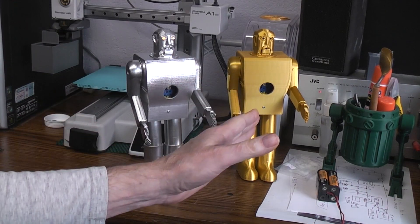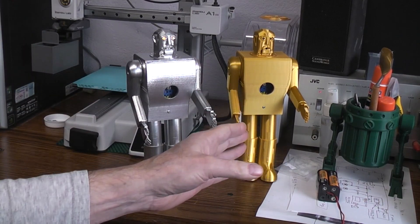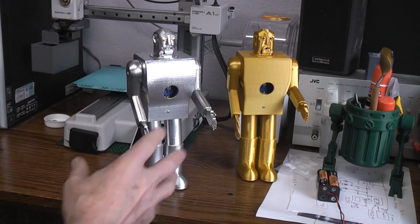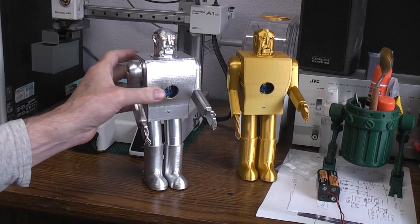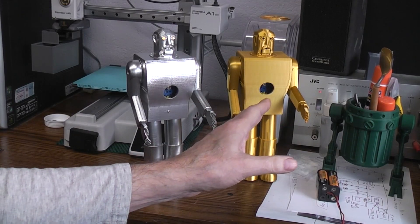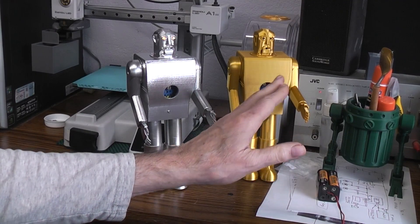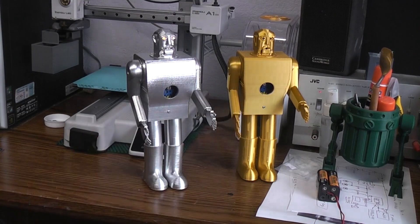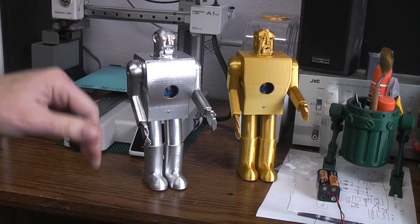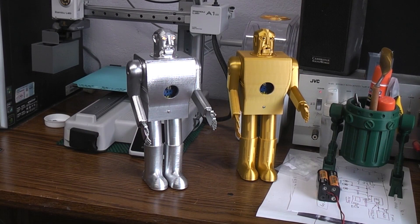I do like the idea of three batteries instead of two because it simplifies the circuit by eliminating the boost circuit, extends battery life, and gives the TT motor four and a half volts instead of just three — all things that favor going that direction. As soon as I have enough time I'll upload a new file to Thingiverse with the changes I made for separating the legs, the three-AA battery configuration, and a link to this video for people who want to do the speech recognition. In the description of this video there'll be links to all the previous videos that led up to this so you can see how to build it and make it all work.